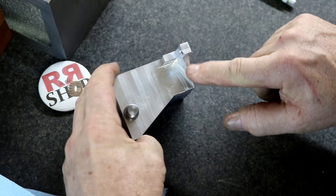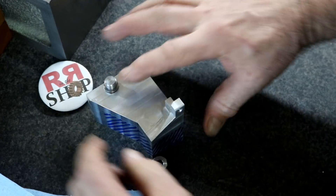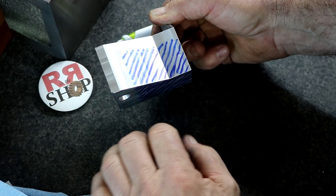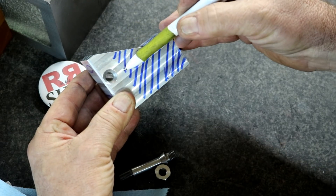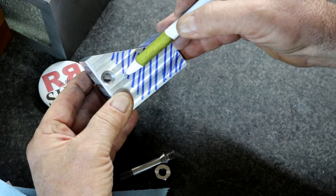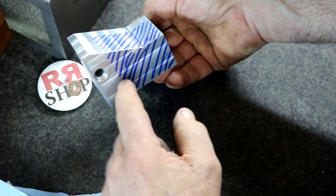We did this feature here with the radius and our stop and our spot for the pin. So that's where we're at. We're going to go get this milled all out, hogged out. As we come down here, we're going to have to come back because we're going to leave a little 60-thousandth protrusion by 100-thousandth wide guide rail in here to fit in a groove.